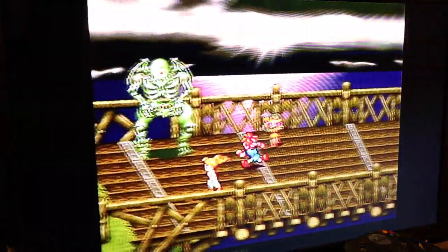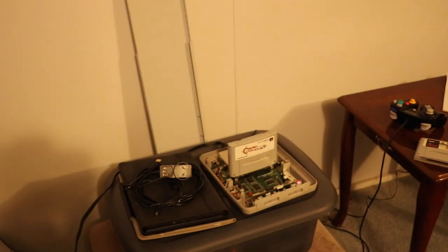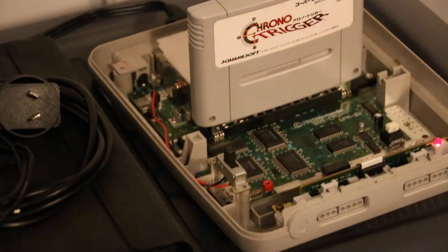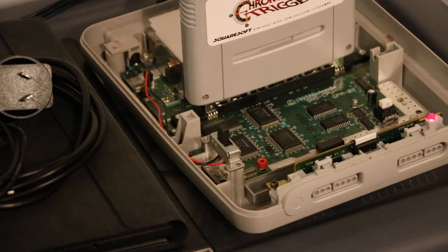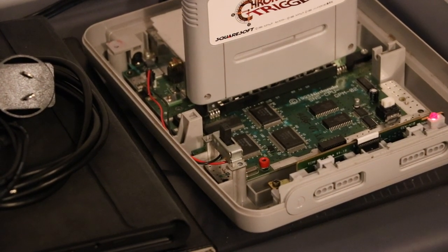So I'm going to go ahead and completely disassemble. Now, I've already partially disassembled the Super Nintendo there. Sorry, Super Famicom. And it's not a one-chip model, it's one of the older ones. GPM-02, SNS CPU, GPM-02. So we'll go ahead and replace the little voltage regulator there first.